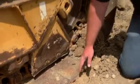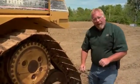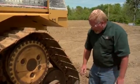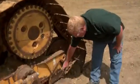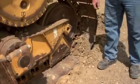That means this track pad has actually been striking this rear guard. What can cause that is running on a side slope, running over rock, or possibly some loose material. It's just something we really need to watch, because the last thing we want to do is get into this big metal structure here, have to cut that off, and re-weld on a new one.